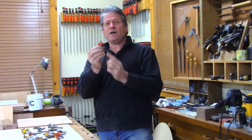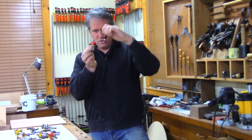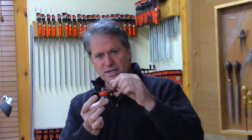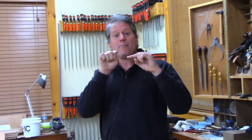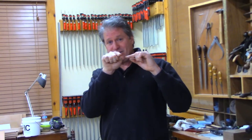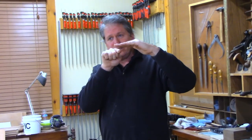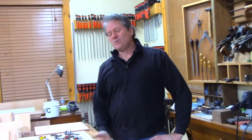So it's where the barrel of the hinge is on the joint. But I'm pretty sure, as I recall, I used two half-inch, the opposite of a cove and a bead, and set the depth and worked it out. I always would draw the profile and then show where the barrel of the hinge is going to be, the center of that barrel, because that's the axis when it comes down. The outer piece that folds down cannot reveal a gap. It has to be high enough. So anyway, I'm getting in the weeds, but that's what I use.